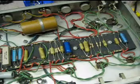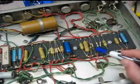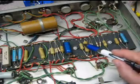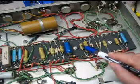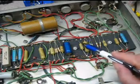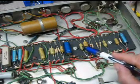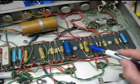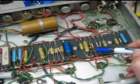The big difference between the earlier and the later Bassmans is the tone stack, which is right here. In the Marshall, you have two .02 coupling caps for the mids and the bass. In the late 59 Bassman and the later Super Reverbs and so on, you had a .02 for the mids and a 0.1 cap, which is much larger, for the bass.